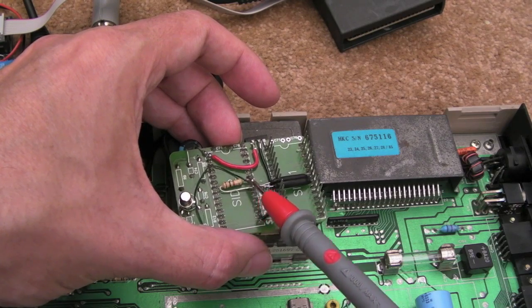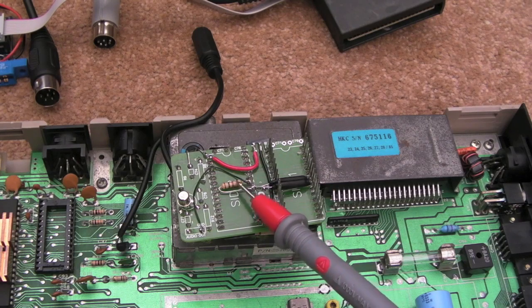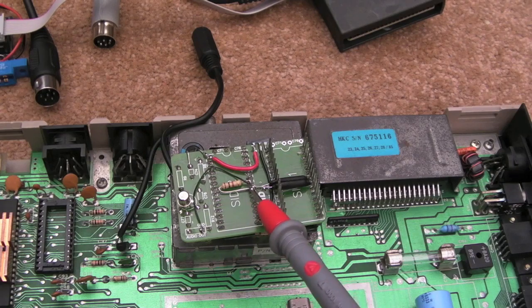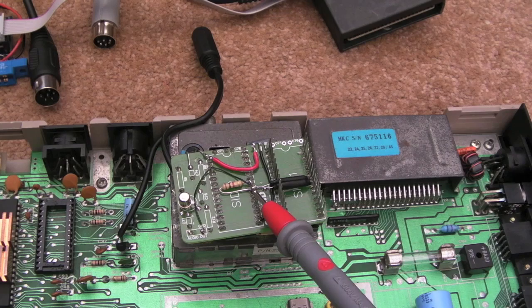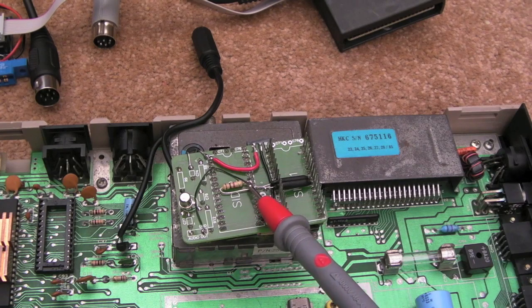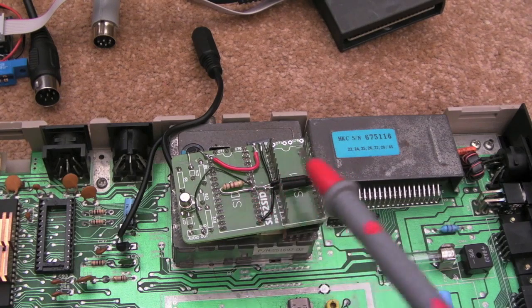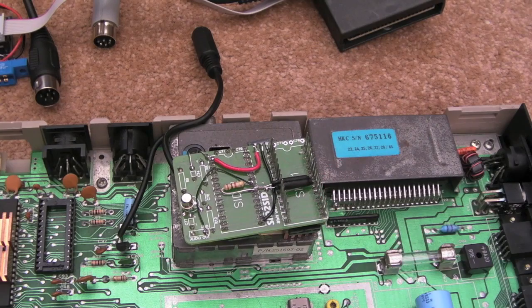I tried this earlier today and couldn't get it to work. Having revisited it, I tried a lower value resistor - I had something like 4k7 previously and it was really glitchy. With a 1k resistor from ground to the chip select, it works. You need that pull-down because when a low is being driven through the diodes, this pin is going to be almost high impedance, so you need to pull it low. The size of the resistor might not be optimal though - is 1k too low or too high? The logic level is roughly 3.5V, and it drops to about 2.9V or so, which is the 0.7V diode drop.